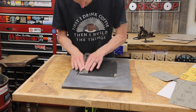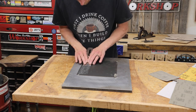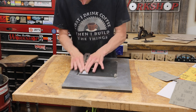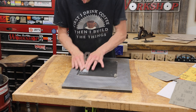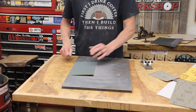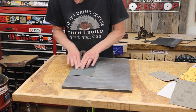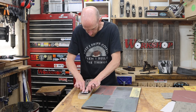I realize there are about a million different ways people like to sharpen their tools, and I'm not really here to tell anyone which way is the right way. But the method I've been using and liking for its simplicity is just using a piece of flat plate steel — this is a piece that has been Blanchard ground, so I know it's dead flat. I use some magnets to hold my sandpaper in place, and with my sharpening jig I go through at least 2000 grit on the steel plate, then finish up with a few passes on a leather strop.